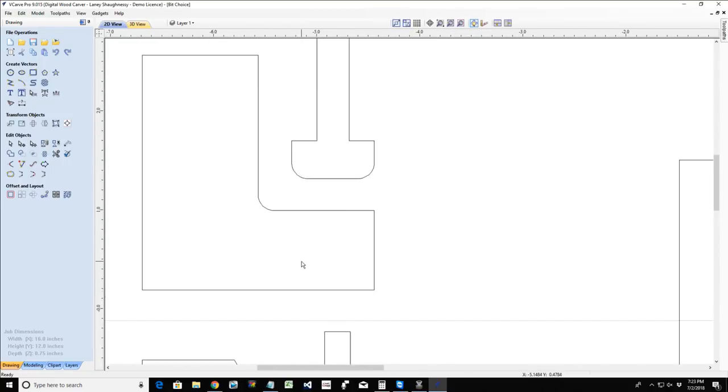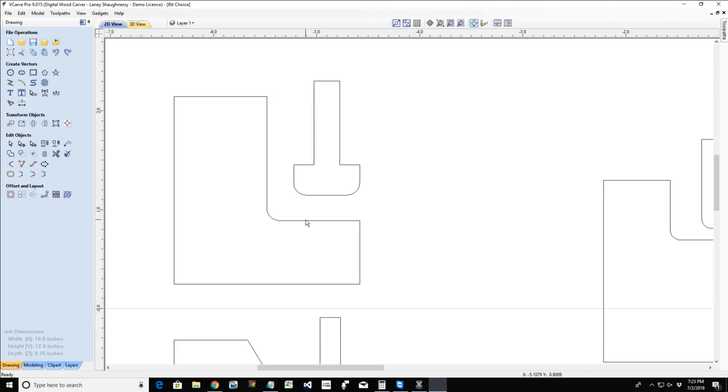Now, if I'm doing a pocket cut and maybe I'm making a bowl or something like a chip and dip tray, and I'm using a bowl bit, well, that bowl bit has a radius on the cutter. And so I'm going to get the straight wall because of the cutter itself. But as it gets to the bottom of my pocket depth, as it's cutting across, I'm going to end up with that radius, whatever the radius is of the router bit. So the radius of my bowl bit is going to determine the radius of that curve at the bottom of my cut. And we generally want that for our bowls and trays, so we have that nice transition from the side of the cut to the bottom of the bowl. All right, so those radius bits, those bowl bits.